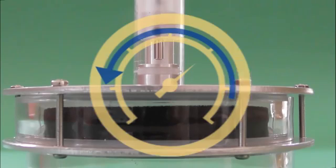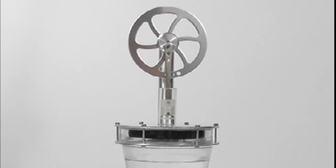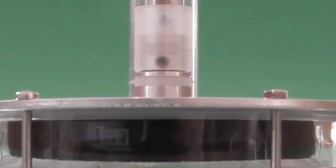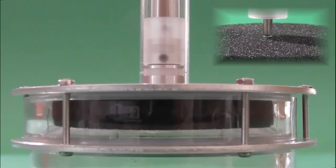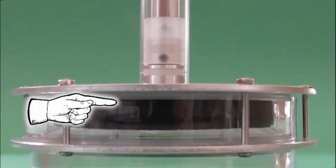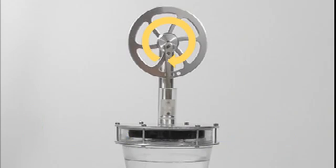At this time, the total pressure inside the chamber decreases, and the atmospheric pressure pushes the piston down, because now the atmospheric pressure is greater than the pressure inside the chamber. And the flywheel continues turning. When the magnet at the bottom of the working piston returns to its lowest point, the two magnets are well within each other's magnetic fields, and therefore the displacer is attracted back up again to the top of the chamber, displacing the cold air back down to the bottom of the chamber. And we have completed one full turn of the wheel — right back where we started from.